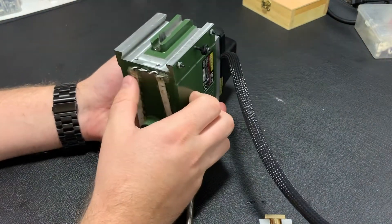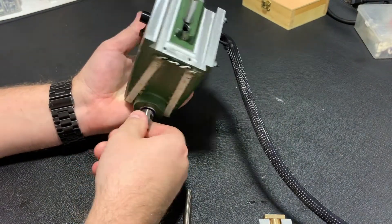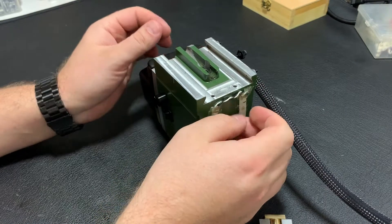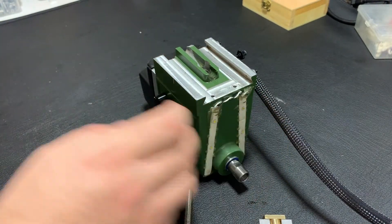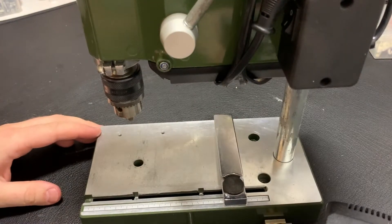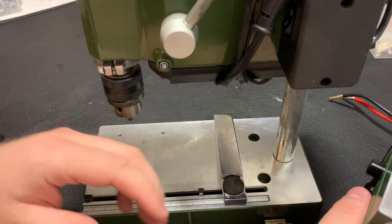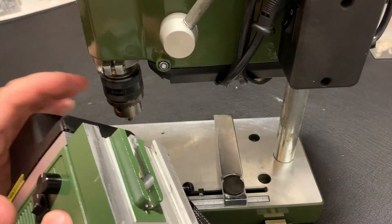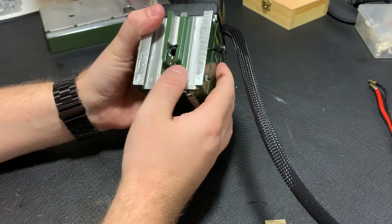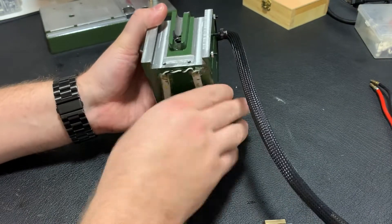I couldn't make this wider because there are already holders from the tower. To make these trims I will need to remove all the electronics, or almost all the electronics, and the shaft. And as I don't have another milling machine, I will use this drill press. I measured it — it will be possible to mount a small cross table here and hold this head on the cross table. Will I have some accuracy? I'm really not sure, but I hope I will not destroy it.